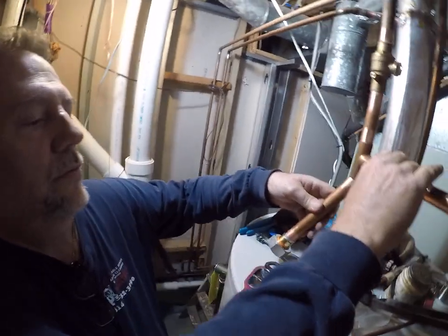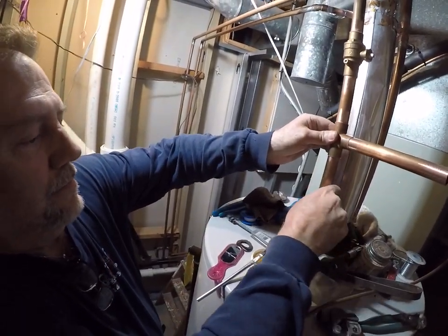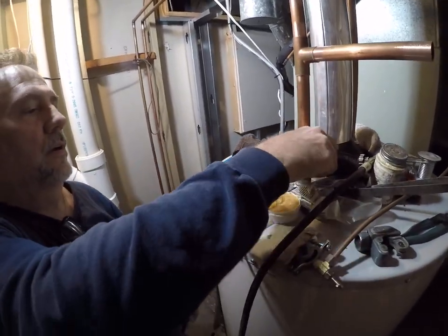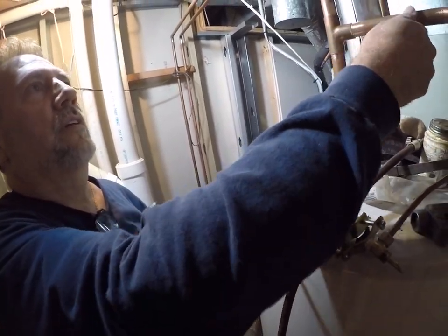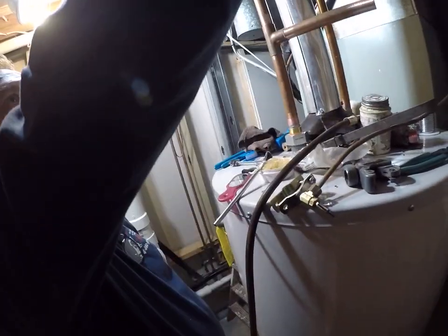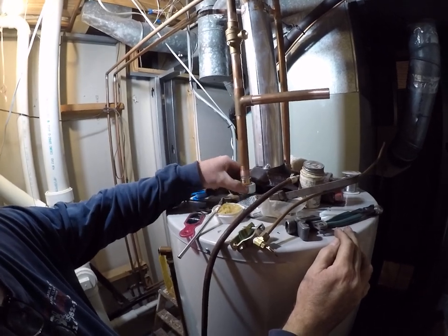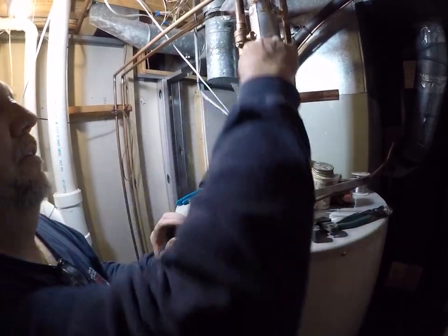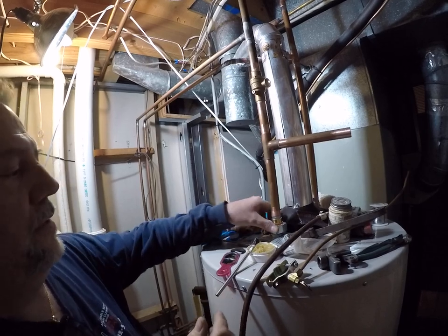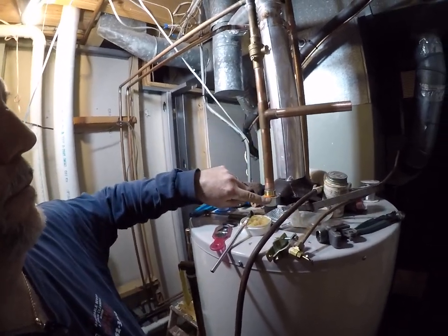Okay, this is already fluxed. What I'm gonna do, get that in there, slide it over here, get that started by hand. This is for our expansion tank. We're gonna kind of, well, you want to keep it away from this, but we're going to 90 this up. You want it 18 inches where we're at here in Missouri, the code. And you want your tank in between your shutoff and your water heater. So that's how you get the dielectric on there. Don't forget your rubber. But after we get everything in, we'll snug these down.